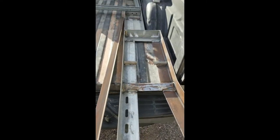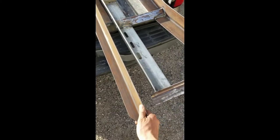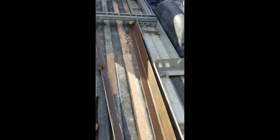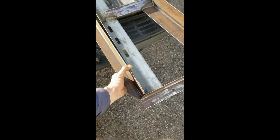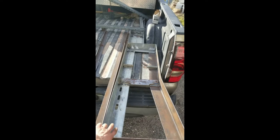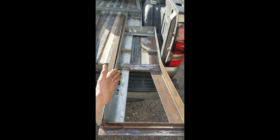As I was jumping on this and putting a lot of weight, that's starting to twist quite a bit. So we decided to get an extra stiffener in here. So we got another piece of angle we're just adding to it. Got it notched, slide up and under that piece there. Weld all the way out on the back here. So essentially, it'll give us a nice stronger backbone than this metal here. If I was to do the whole project again, I would have just used something heavier on here. We thought it was gonna work, but with the way it comes.